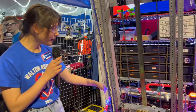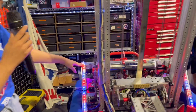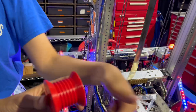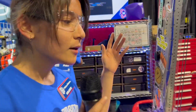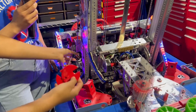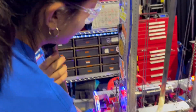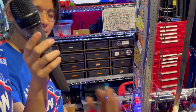Our elevator is powered by a winch system. There are two pulleys in the back powered by a single Neo 550 on a 49 to 1 gear reduction. The pulleys are made of PLA and allow the Dyneema string to wind up perfectly along the screw lines, making sure the strings are completely even on both sides — which is really important for our elevator to be even once it pivots. These clips help us tension the string and keep it even at all times. It takes us less than a minute to put them on between matches.